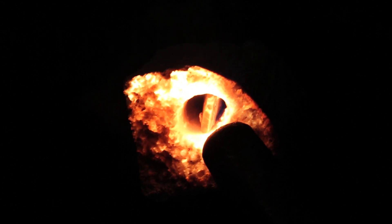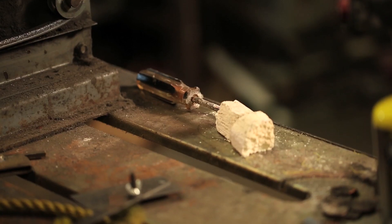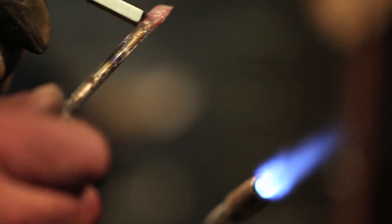You need to normalize that steel. Heat it up until it is red, then let it cool slowly. Heat it up again until it no longer attracts a magnet. It has gone from tool steel to steel of infinite possibilities — exactly where you want it.